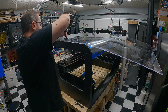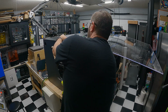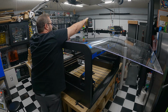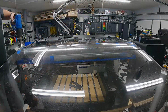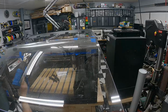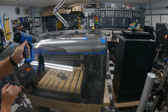The first thing to do is to put that large flat sheet up there and mount it to all of the hinge points. Now, my thought was, I'm going to mount it to these hinges, and then I'm going to heat it up and bend it around that stovepipe, and everything's going to work perfect. I always underestimate the amount that is going to carry through. So the fact that I'm using that blue tape, masking tape, ends up leaving some impressions in the acrylic, which is so sensitive. You really have to have a polished form or forming buck, whatever you want to refer to it as, when you're doing these thermoplastic bends.